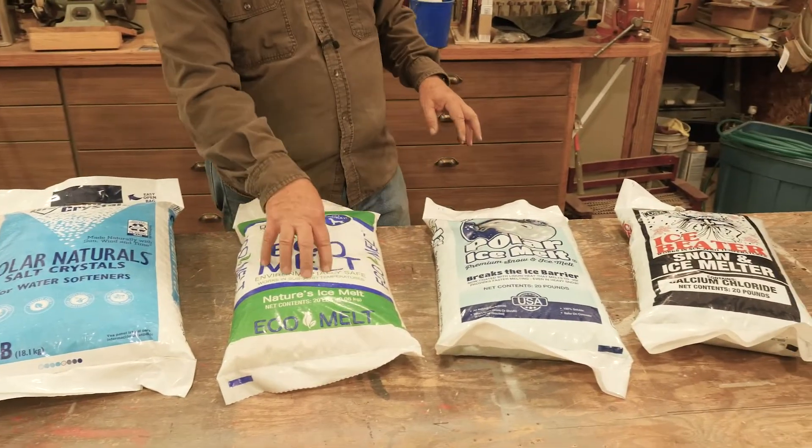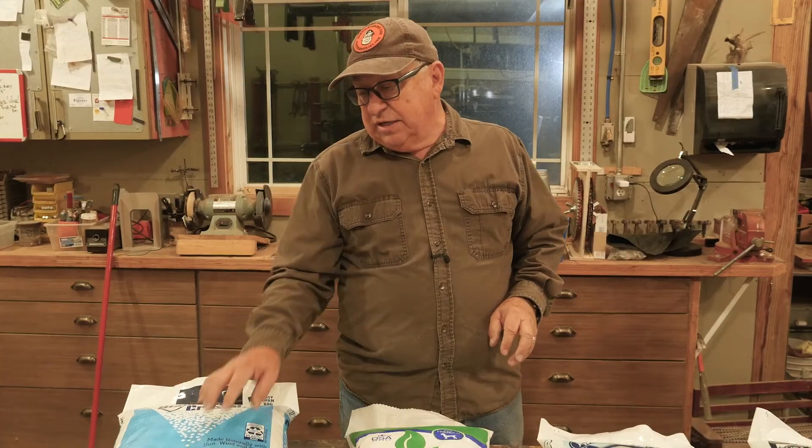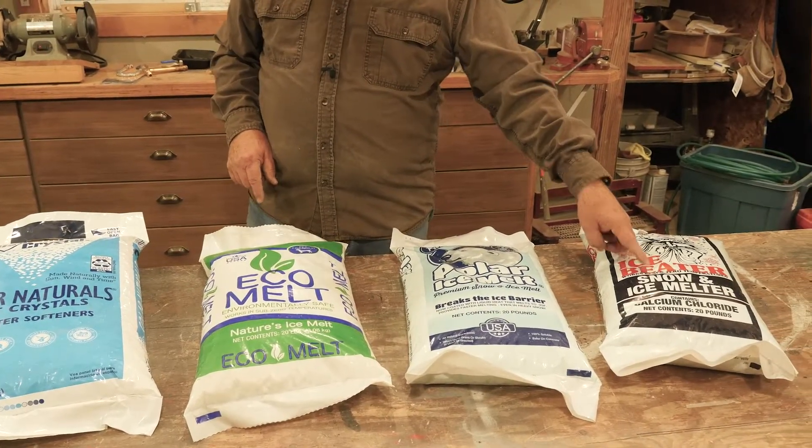The enhanced products cost about one and a half times more per pound than plain rock salt. The calcium chloride product is even more than that, but you only need to use lesser amounts, so the economics kind of balance out and you get better results. Another negative with regular rock salt is the granule size may not be optimum for melting down, so brine formation does not occur quickly enough and you end up with larger chunks. You can understand it would take longer to melt something large versus something small. The enhanced products are made with the right granule size so they slow release and create a longer burn of the brine solution.